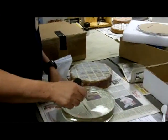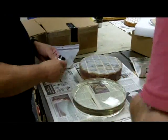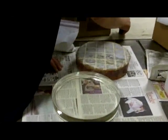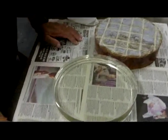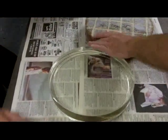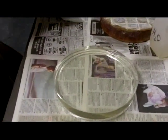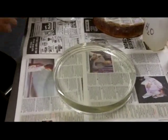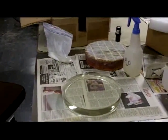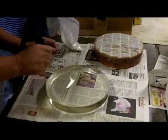Right now they're using a laser looking through this 10-inch mirror that Glenn Fitzgerald's been working on, and he's down to the polishing stage now. It's a beautiful mirror. And he can tell with the laser that the edges still need to be polished a little bit because the laser gets a little fuzzy when it gets around the edge. It's real sharp down through the middle, but right out at the edge, it gets a little fuzzy. So it needs a little more polishing. And we're going to demonstrate that polishing technique on an actual mirror that Glenn has been working on. It's a 10-inch mirror.